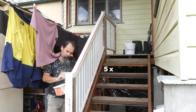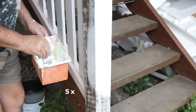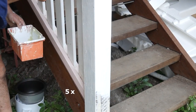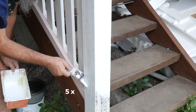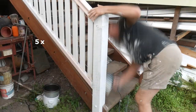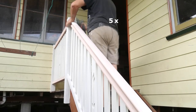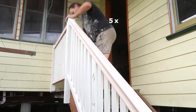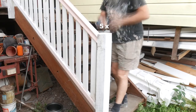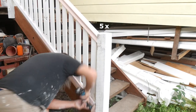It's important we fill in all the gaps and cracks so water doesn't get in, as this can cause the paint to peel. Although where these steps are located they get very little direct sunlight and only the bottom area gets rain because there is a roof high above. We then orbital sand the primer with 120 grit to remove lumps and bumps, and it shows up any flaws that may need filling that we missed before. A detail sander is used to get into all the hard to reach spots the orbital sander couldn't reach.